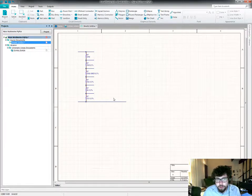More to the point, I wanted more than 100 volts input, and since I have a 4-digit display that I'm going for, and the biggest digit will go up to a 9, unlike a traditional 4.5 digit or 3.5 digit multimeter, my maximum count is 10,000, which means I'm either going to go 100 volts and have 2 decimal places, or 1,000 volts and have 1 decimal place. So that's what I get.